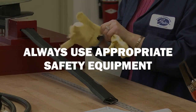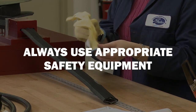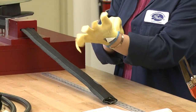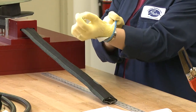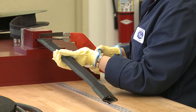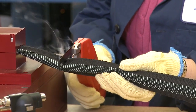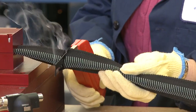Be sure to use the proper safety equipment — safety glasses and gloves — when using the hot knife. The hot knife melts the white lining of the sleeve to the black skin of the sleeve, providing the proper opening for hose insertion. Once you have the sleeve in proper position, cut it with the hot knife. Make sure the cut is straight.